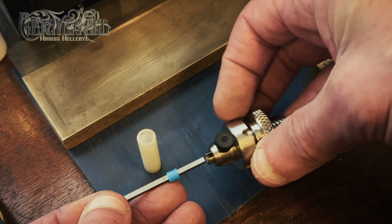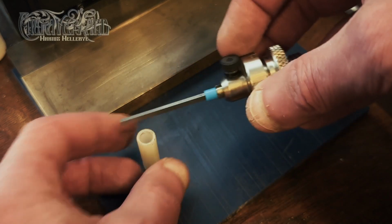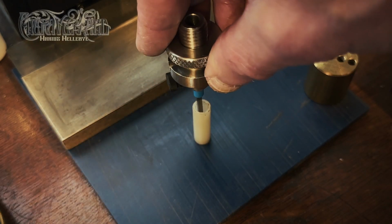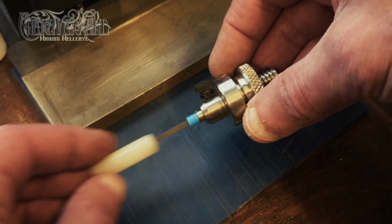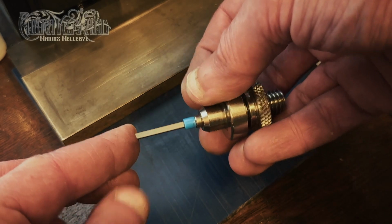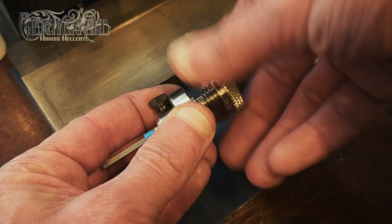Put a bead at the end of your blank graver and stick it in your sharpening fixture. Put it in the little plastic tube that followed your sharpening set and let it slide till the end. Then you have the correct length to start sharpening. The place of the bead is also very handy for quick touch-ups later.